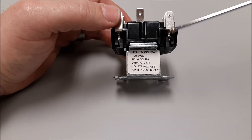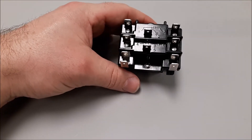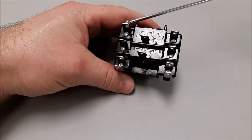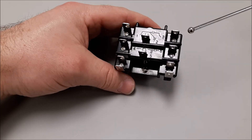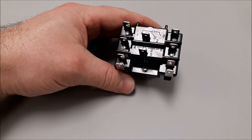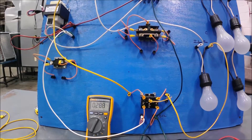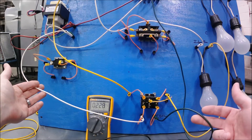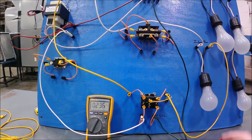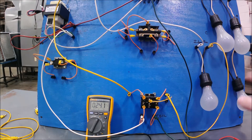No matter how this is working, or if you're only using one set of switches, both sets are identical in their makeup — normally open and normally closed — and both react instantaneously with that 24-volt signal. The last thing I'm going to show you is voltage checks. I've got a 90-340 relay wired up on a practice board with 24 volts to the fan relay coil.